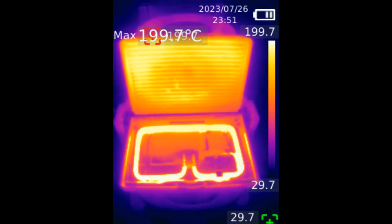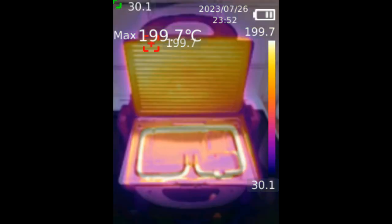The colorful heat patterns are a testament to the Joule phenomenon taking place within the resistor. As electrical energy flows, resistance challenges the electrons, converting electrical energy into heat. This heat radiates from the resistor and spreads throughout its surroundings, reaching its maximum temperature during full operational load. The thermal camera can combine the actual image with the thermal image, as shown in this photo.